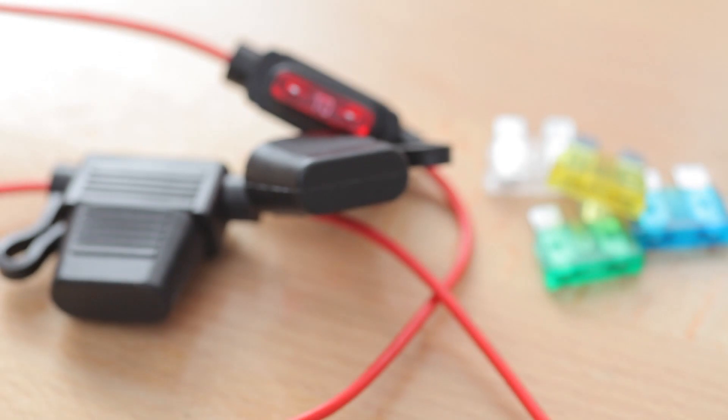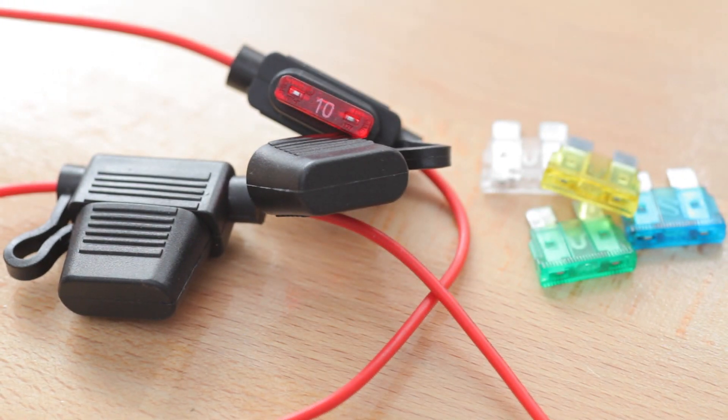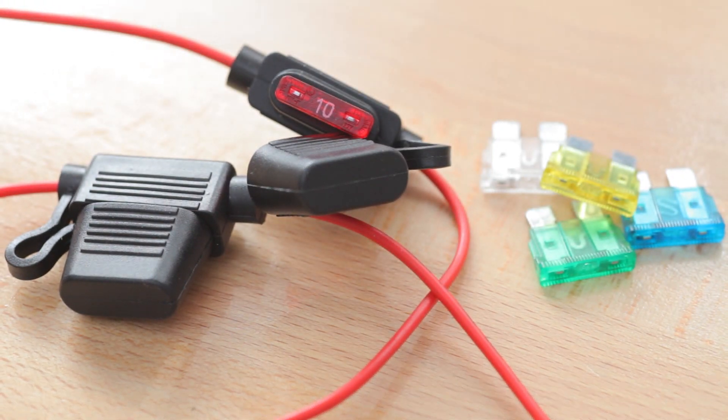And last but not least, three, the polyfuses rely on heat to trip them. I've seen some people use fans to cool the fuses and keep them from tripping, but even under normal use, every now and then a fuse might heat up enough to almost trip, which can cause some pretty unpredictable behavior. Thankfully, these fuses are pretty easy to fix. Just short them out and add some automotive fuses to the power input wiring. You can get fuses and fuse holders like these for a couple bucks at most automotive stores, or even at Radio Shack as long as those guys are still around.